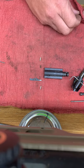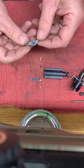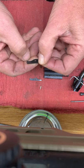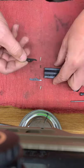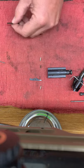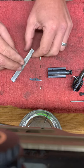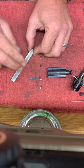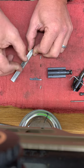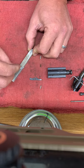There is one little thing that I do whenever I pull these out of customers' guns: mainly because you'll get a little bit of a burr and they may not pivot smoothly in there. So I'll just take a fine square stone, set the extractor on it, and just stone it down smooth — take any burrs off of either side.